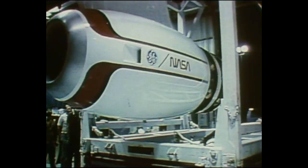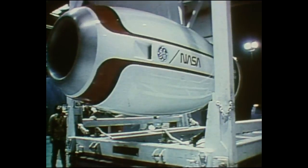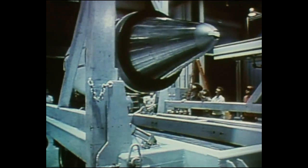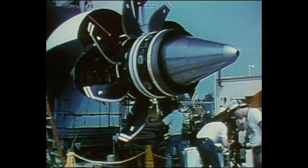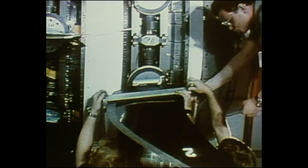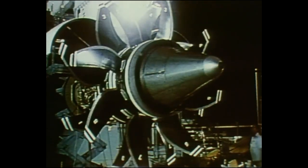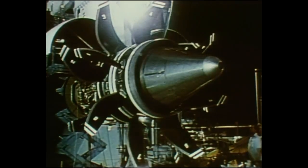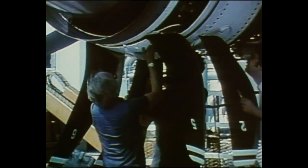In the prep to test area at Peebles, primary instrumentation was completed, a flight type nacelle was installed, and the UDF transferred to a transportation dolly. The unit was transported to site 4A and mounted into the crosswind facility where the fan blades were installed. The position of each blade was calibrated and the variable pitch mechanism was checked out. Nacelle panels were assembled to the engine to provide a proper airflow path into the fan blades.